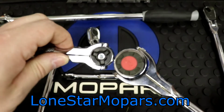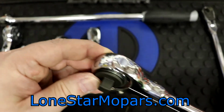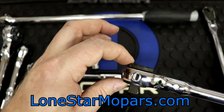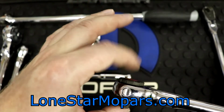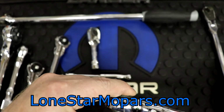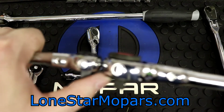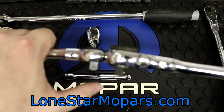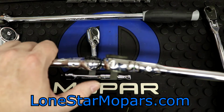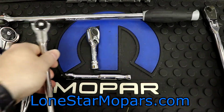Again, comparing it to the compact and intentionally designed KTC. If you take the height basically from here to the top of the selector switch, you're looking at 23.9 millimeters. If you go from the bottom of the anvil to the top of the switch, the red directional arrow, you're looking at 34.3. So again, 3/8 versus 3/8, look at that, okay? Now, you can offset some of this because it is a Roto head, but that little KTC is super thin comparatively. Also, yes, the KTC has the tri-Y type of a thing. This has the speed wheel. Take from it what you will.